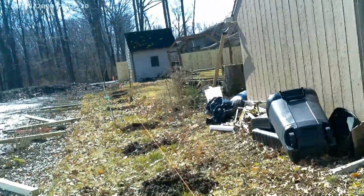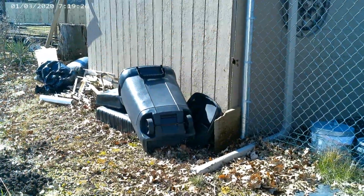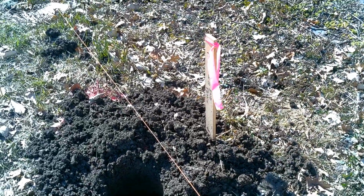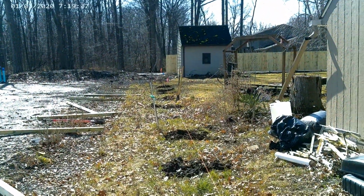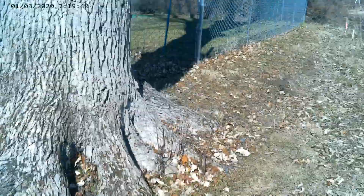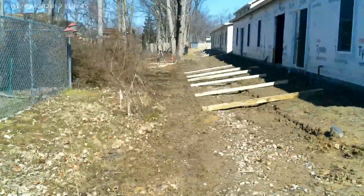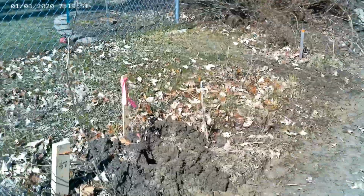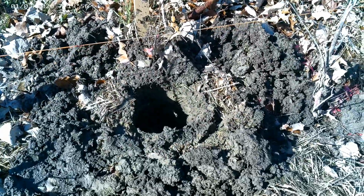Here is a 75 foot stretch, a 72 foot, drilled the holes, strung it. That stake is the property line. Then we string it 10 inches off the stake, drilled the holes every 8 foot, all the way down there. And all the way down here. There's a string, property line, hole, all the way down here.